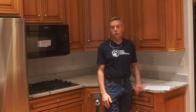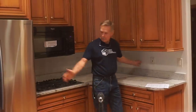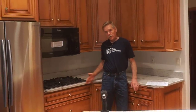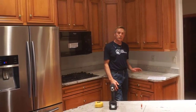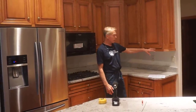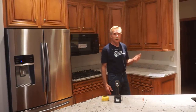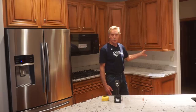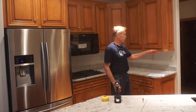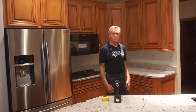This kitchen gets a thorough update and upgrade, which involves shortening this wing wall back to the depth where the countertop is here, to eliminate these corner cabinets. The first thing I need to know is what's going to be involved in removing that wing wall — whether it's a bearing wall, whether there's plumbing or HVAC ductwork in there — to tell the homeowner and the designer if it's feasible to remove this wall.